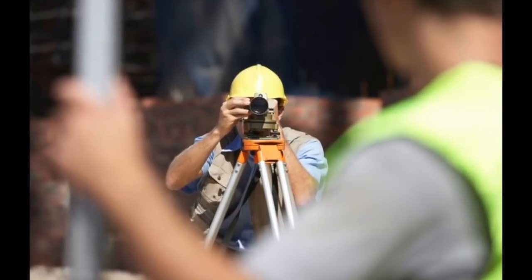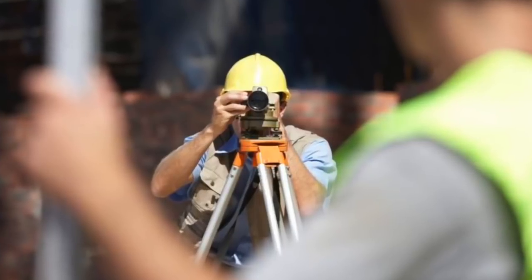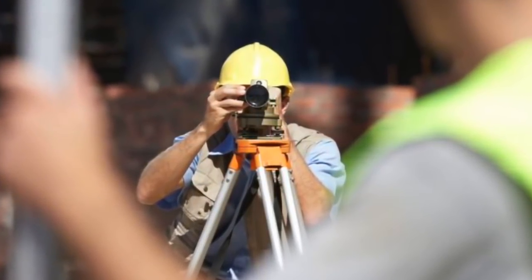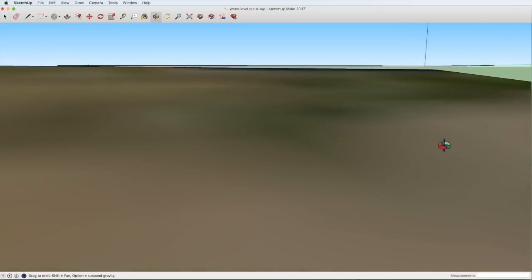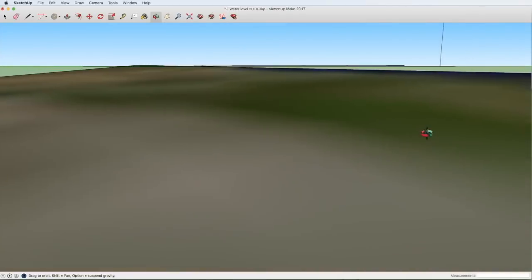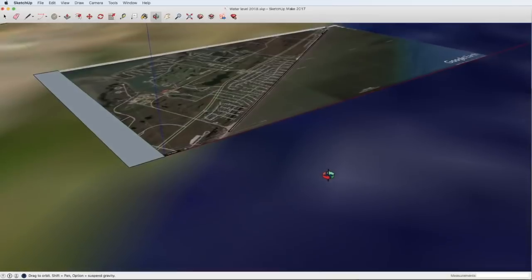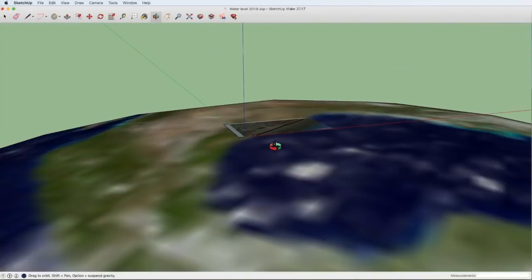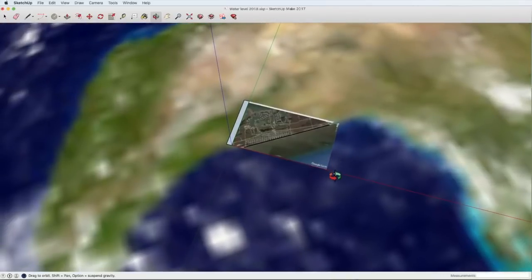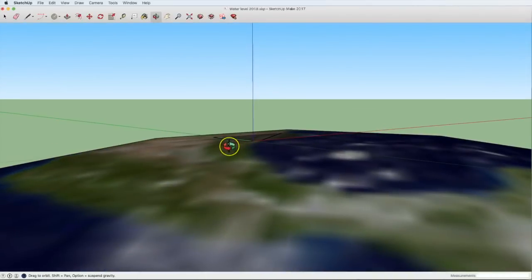The surveyor's job will be to transfer the mark that we put on the first pole all the way to the last pole, making sure that it's perfectly level the entire way. We will be verifying that the surveyor's marks and the water level say that it's perfectly level each half mile, the entire length. Because we are burying the posts 2.5 to 3 feet deep in the sand, and they're 8-foot posts, we're going to have 5 to 5.5 feet of posts to work with.